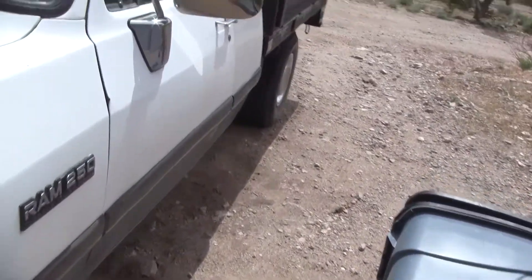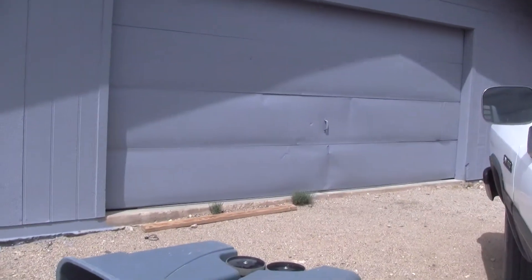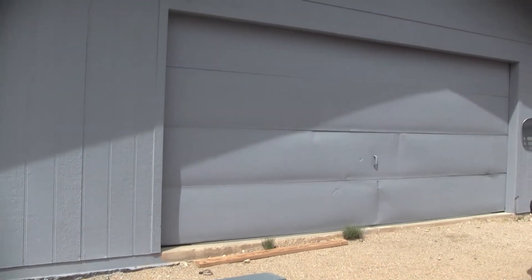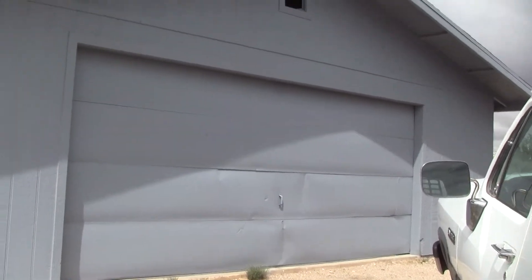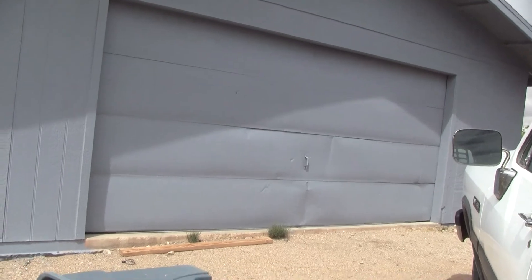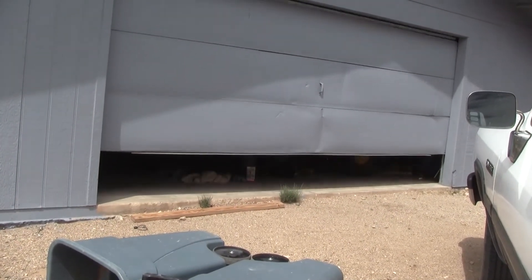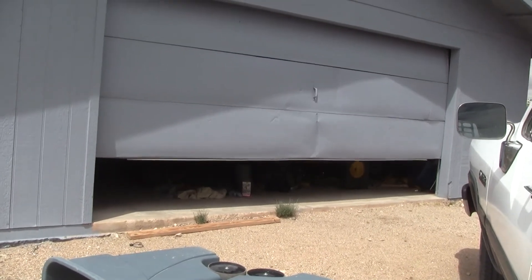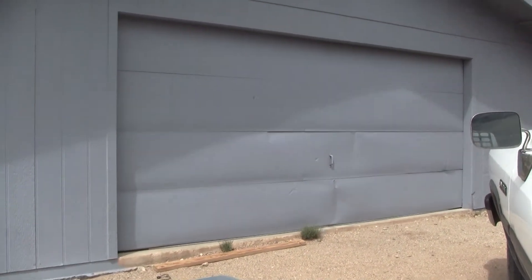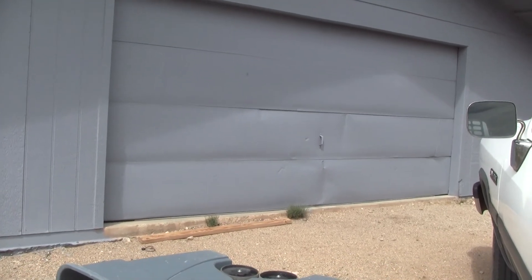So this led me — doing all the lubrication and changing rollers — loosened the door up. It's still pretty tight, not terribly smooth, but it was so much smoother, it showed me that the door wasn't balanced properly. It needs to be where you lift it about halfway up and it'll just sit there. One of these days I'll go in and tighten that spring maybe a quarter of a turn to get it more neutral, but right now it's completely stopped with this whole reversing thing. It's been working really good. About six inches lower than it is right now, it would just stop, shake, and reverse itself. Like glass. For now we'll call it fixed — maybe not perfect, but it's an old beat-to-hell door, so at least it works for right now. See ya, bye.